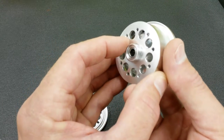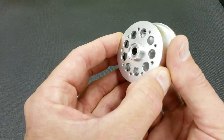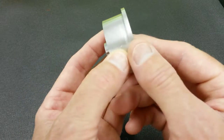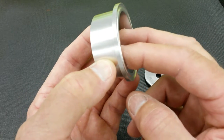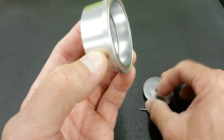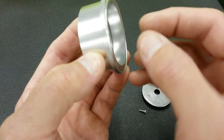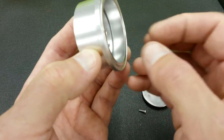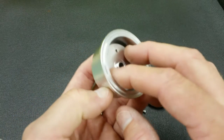Although you run a longer screw through there, you may need to put a spacer in there to keep it from wobbling, because you could over-tighten one side and get it out of alignment, which would cause your brake disc to rub on the magnet for your brake. So that's what I was trying to explain in my email. Hopefully this makes it a little bit simpler to understand.